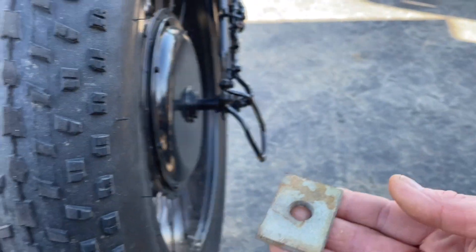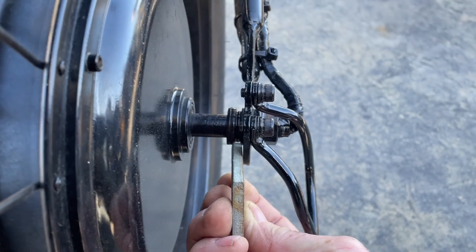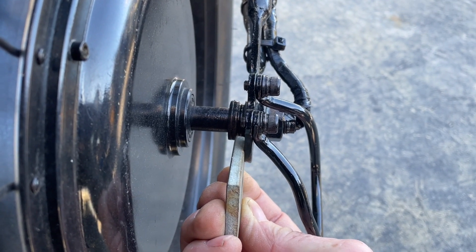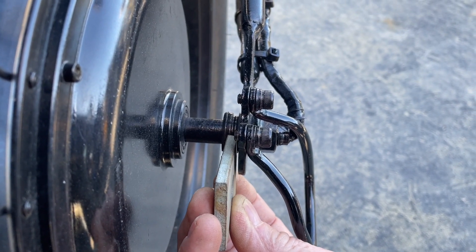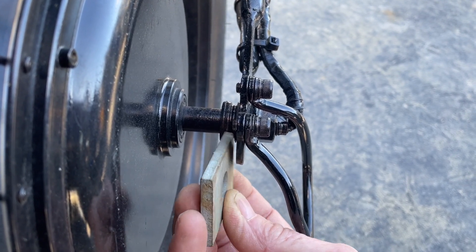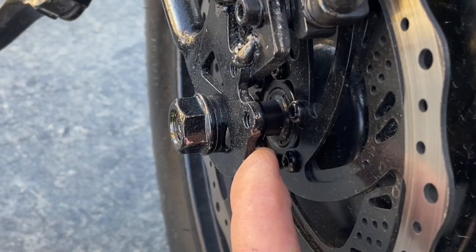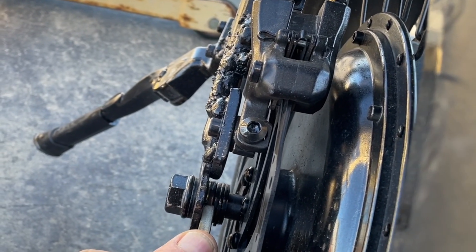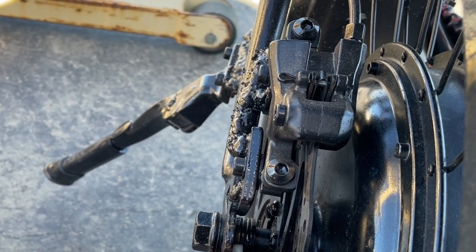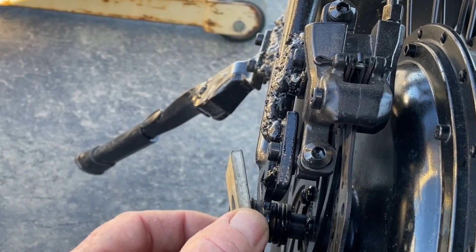I got a couple of fairly heavy-duty guys here — much thicker. I don't want to get too heavy duty because I have to get a spacer in there. I can take out that big bunch of spacers except maybe the two on the inside. I got to cut a slot in here so it's the same size as these slots, and then I'm gonna weld that on the other side too — cut it, slide it in there, and when it's all slid on real nice I can take out about five washers and be down to just one or two washers.